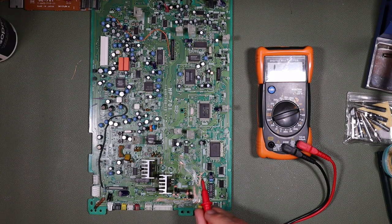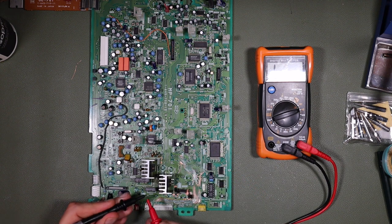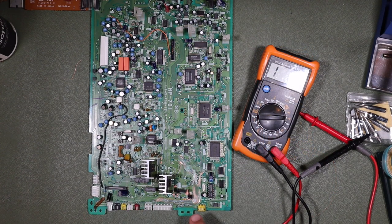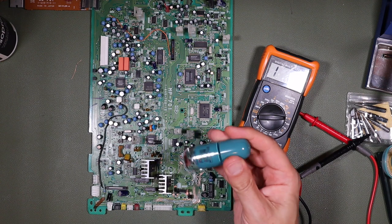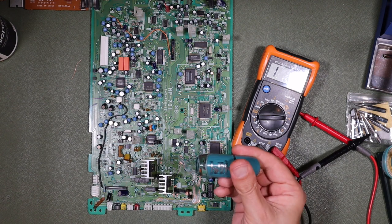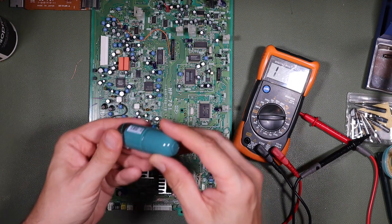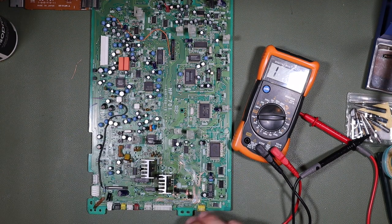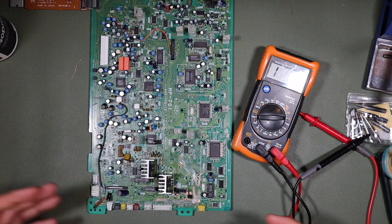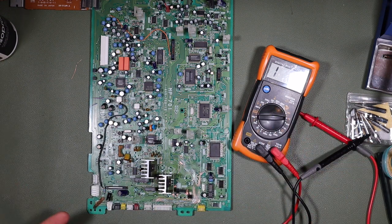I think I now have all of the tracks repaired. I'm going to test them with my multimeter on continuity and check everything's connected as I would hope. I'm satisfied all the tracks are intact, so I'm going to clean them with IPA and cover the exposed tracks with a little bit of nail varnish — you should use solder resist, but I don't have any. I bought the nail varnish just for this purpose. I checked it's not conductive — put a little on the board, measured it with the meter — no metallic particles in it. If it doesn't work, well, the board didn't work before, so I'm no worse off.